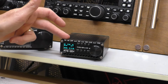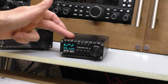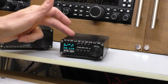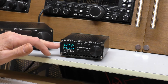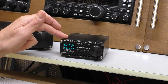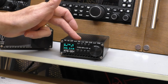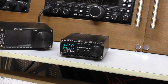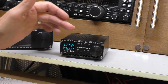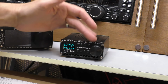Overall, shortwave performance is pretty good, isn't it? For something that costs just over £35, all mode, including sideband. And this model was pretty well on tune. I very seldom had to use the BFO. However, it's not perfect, and I do think there are things they could improve if they do a further updated model. When it comes down to the tuning, it is a bit laborious, and it's a good job that they've fixed that encoder because you have to use it a lot.